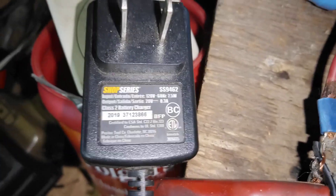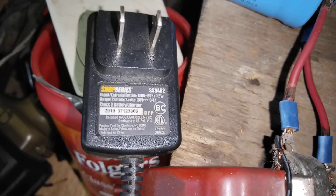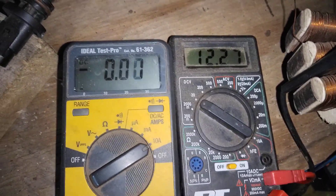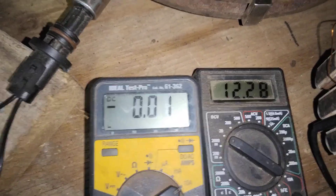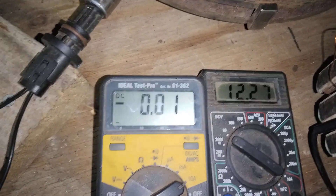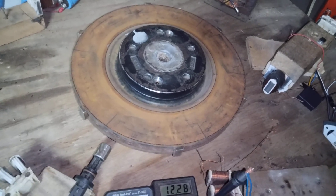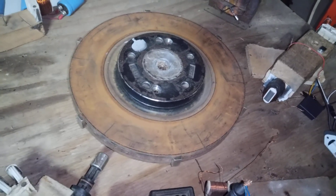The power supply today is this little battery charger — it was originally used in a 3D printer contest entry. We're using the kilowatt meter to show the consumption rate of the motor. The readings will be a bit off due to frequency issues causing the meters to read incorrectly, and there's some cancellation going on inside the motor from the pulse. The motor is wired in the original configuration — three phase, all three sets of coils are center tapped, but I'm not utilizing the center tap.